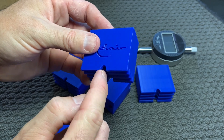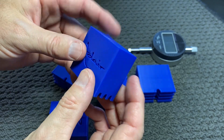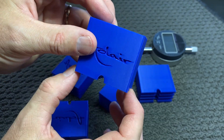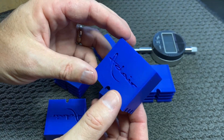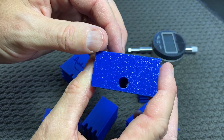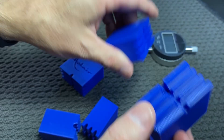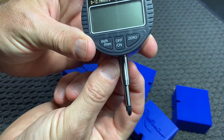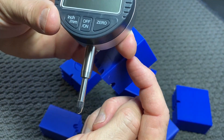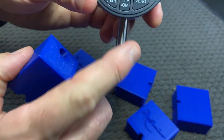I made some ones a bit wider — that is where the fret will go through. I made it wider just to make it a bit more stable, but I found that on this width there wasn't enough room on the outsides to push the string down to get the string deflection. So I then moved to the smaller block sizes. The whole section going through the middle for the gauge is different on all of these, just as I was playing around with different measurements. There's a wider section that sits about halfway down, and then the narrow part comes through the bottom, with a stop designed in there for this part to sit on.